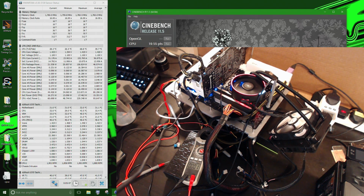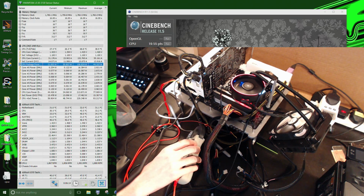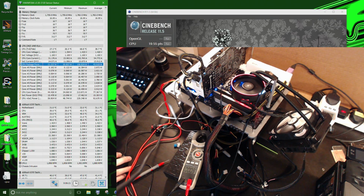And that's not being included in the calculation, because it's basically just doing vCore times this, and then it gets that 229 watts. Well, actually, it doesn't even get that one. So yeah, just don't trust the power readings, because at best they're physically impossible, or my equipment is completely garbage. Though I'm more inclined to believe that this is correct compared to the voltage controller.